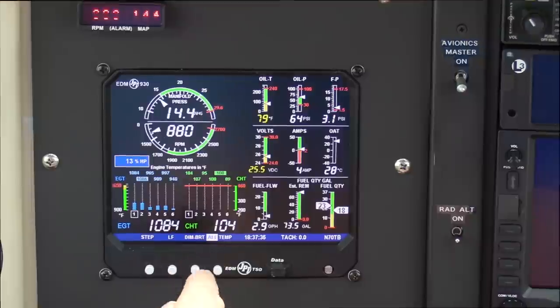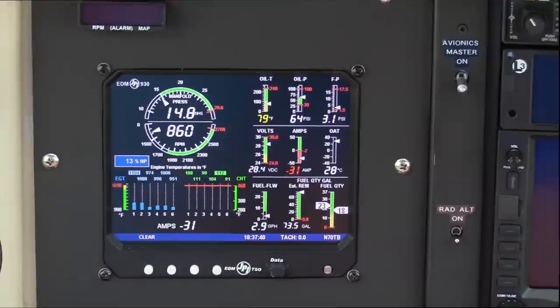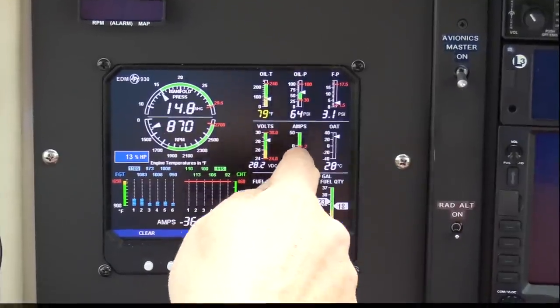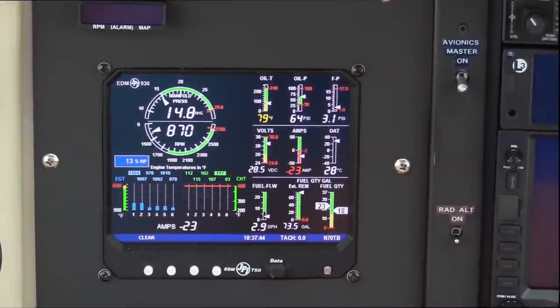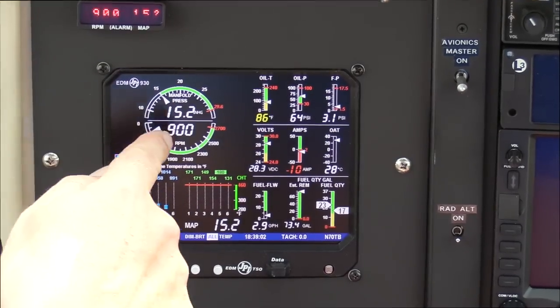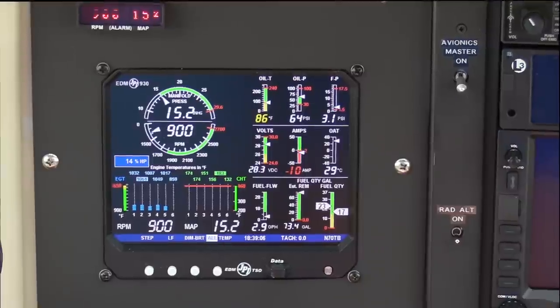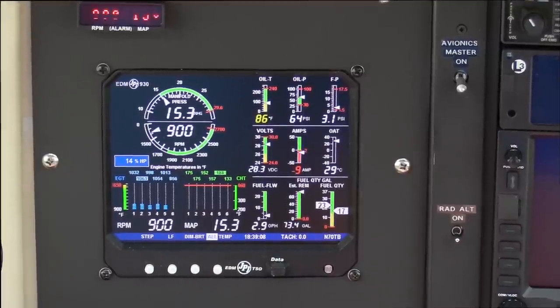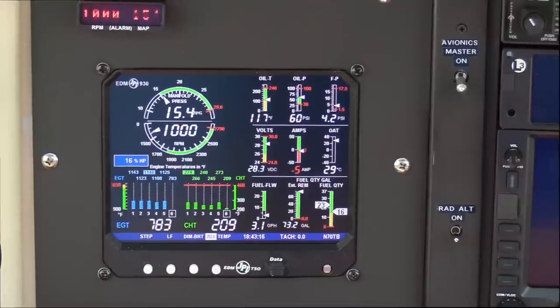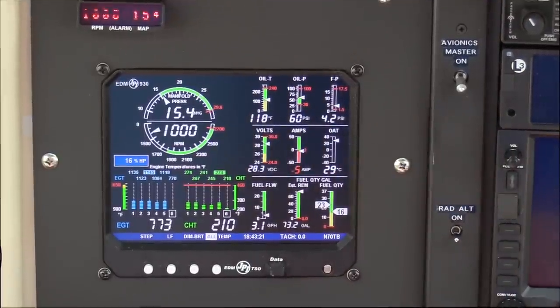Is the alternator on yet? It is — now we get a charge. I think I do have it backwards. I can switch that. I bet that should show a charge now. And we got matching displays here for the red and the real one. It looks like the only hiccup is the reverse polarity on your ammeter, which is like a two-minute fix.